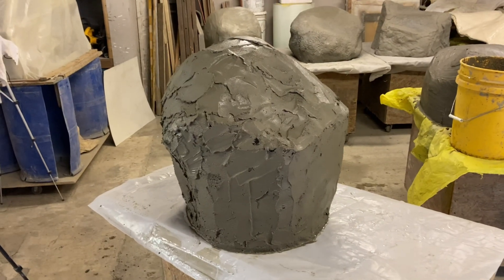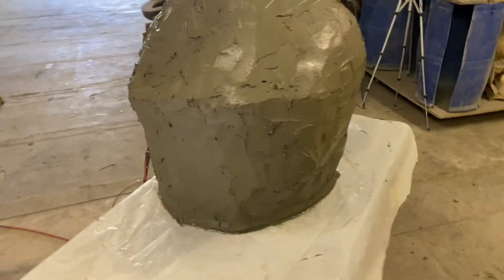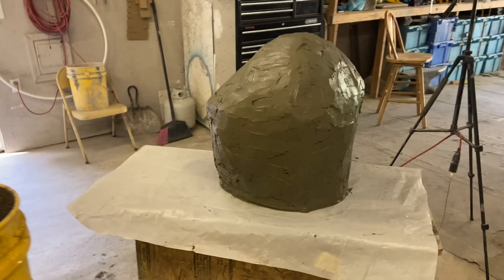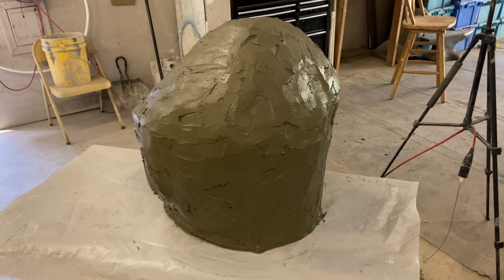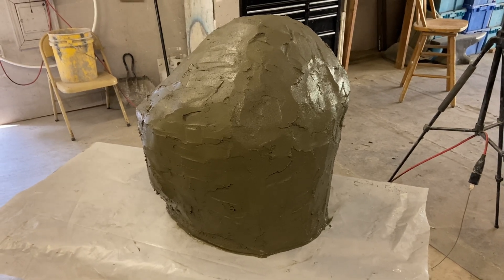The expanded metal has been covered one time. I'm going to wait a little bit then brush it in — all the mesh is pretty much covered, I don't see any sticking out. I'm not really happy with the vertical shape of the sides, but I can alter that with some styrofoam mud. Right now that's the first coat. Tomorrow we're just going to coat it with about an inch of regular mortar — no fiber, no glue, no mesh. The expanded metal is the reinforcement for this product and it'll be tough.